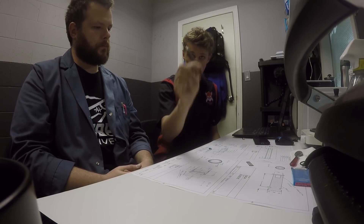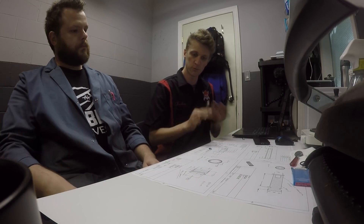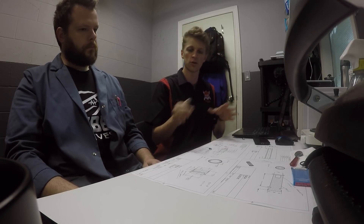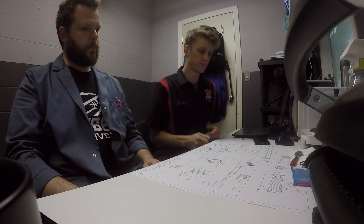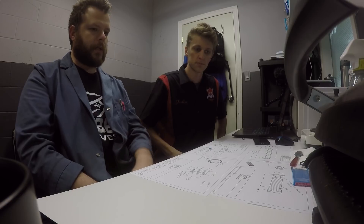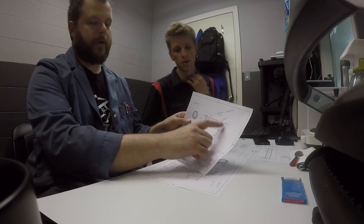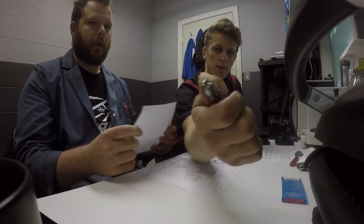To the customer, it's going to be the exact same pen, but on the manufacturing side we've got a lot of process tweaks here and there — polish this, dial in that tolerance, add a chamfer here. Surface finishes even — things down to that give it a big effect on the feel of the pen. The surface finish on the shaft here is very critical and that determines how it feels.